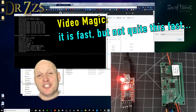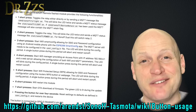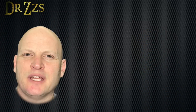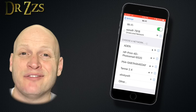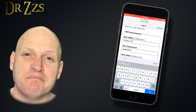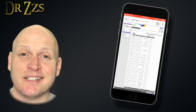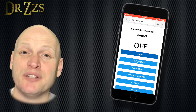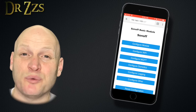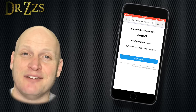You still have to do some things to finish setting it up. With Tasmota you can put the board in Wi-Fi manager mode by pressing the onboard button four times quickly. When you've done the four presses correctly the LED on the board will start flashing rapidly. Go to your available Wi-Fi networks and find the one that says Sonoff. Once you've connected to that Sonoff Wi-Fi you'll be able to put in your Wi-Fi SSID and password. Then the board will restart. Go to your router and get the IP address of the Sonoff, put that in your browser, and that'll open up the Tasmota main page.